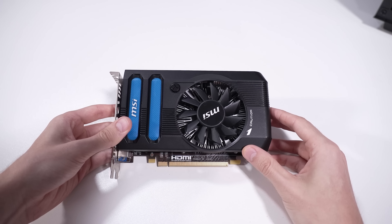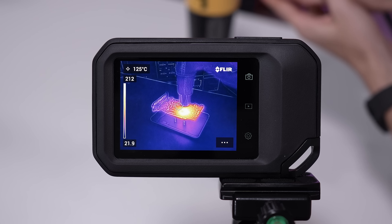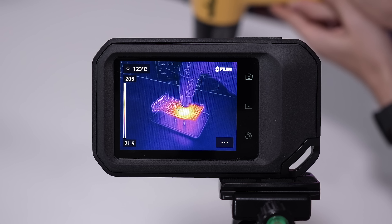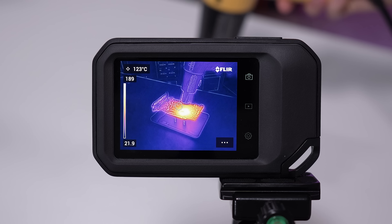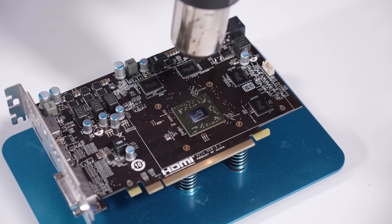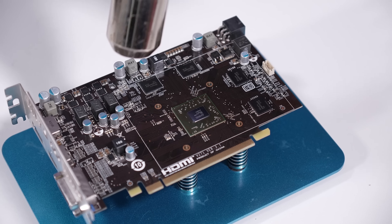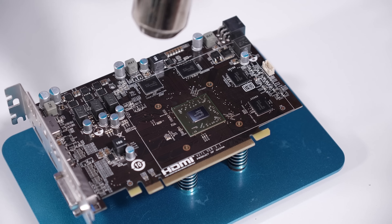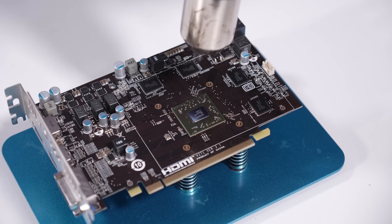Let's crank up the heat just a tad more. I'm going to try to localize it a bit more now — moving a bit closer and lowering the heat output. We're getting pretty close to the temperature threshold here. This is looking good. We'll try to stay in this area for a few minutes. Now I'm going to remove the heat and pulse this for a short while, because you don't want temps to drop too quickly. We're going to try to follow that chart as best we can. You can see that reaching the temperature we reached did no physical damage to the board — that's what you're looking for.